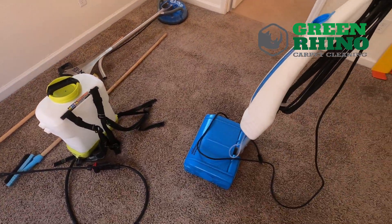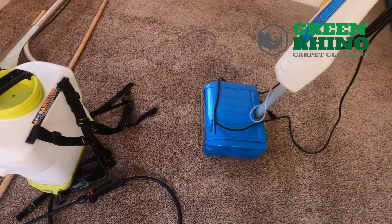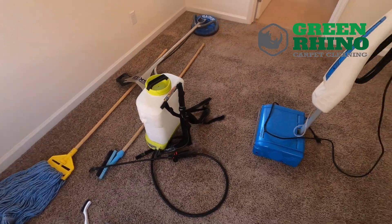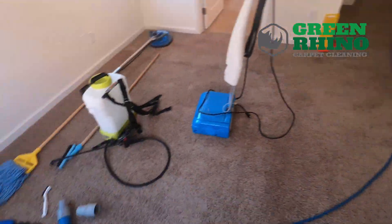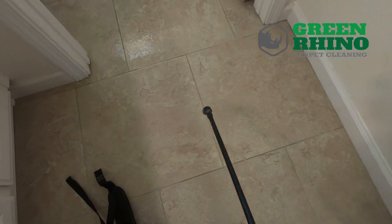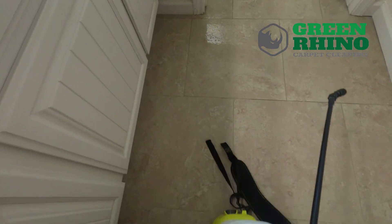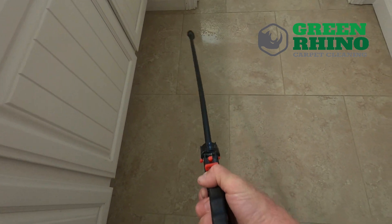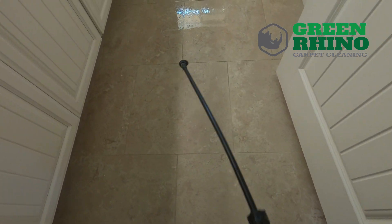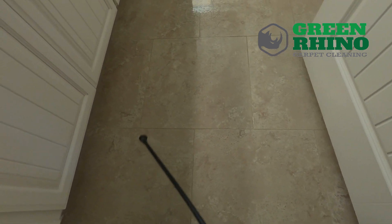Spinner — we're going to pre-scrub with this. I don't have the stiff brushes on there yet, but it should do fine for this job. Carpet details and the pump up. I'm going to pre-spray these first two bathrooms and they'll scrub ahead of me and I'll just be extracting. Spraying in the middle of the room and we're spreading it out with the microfiber along the corners, so we're not spraying the walls or anything like that.